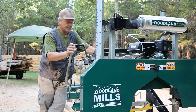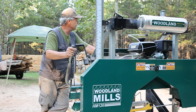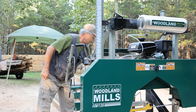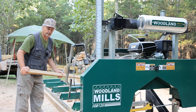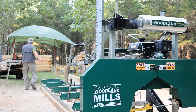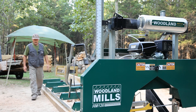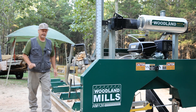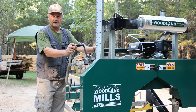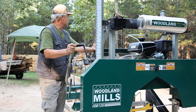We have put just under 17 hours on the saw to mill out everything we needed for a 12x12 cabin. I think I've used about 3.5 tanks of fuel. This little saw has done a really nice job helping us get through this project. I have been cycling through 4 blades, averaging about 2 hours per blade, and each one of those blades was cutting through oak or hickory — it's all been hardwood.